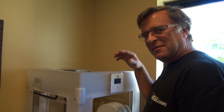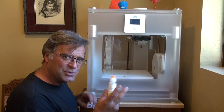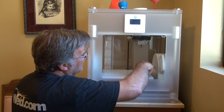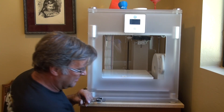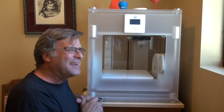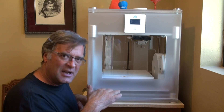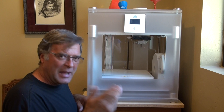So, let me go ahead and put the cover back on and fire it up so you can see it all wake up and get to work. This is the little blue stick that comes with the printer — they send you two cartridges. All you have to do is go inside where you're going to print and just wipe it in a couple of directions, so you've got a little layer of glue on there, so as it prints it's going to stick to the pad rather than getting pulled off. Is it just a regular glue stick? I'm not sure what kind of glue it actually is. In the directions they call it a glue stick. It's a little tacky when you touch it, but when it's all done it's hot water soluble — you take it out, put it in the sink, run some hot water on it for about five to ten minutes and it pops right off.